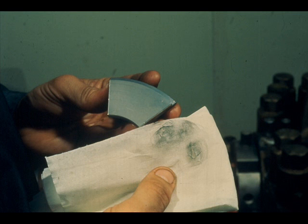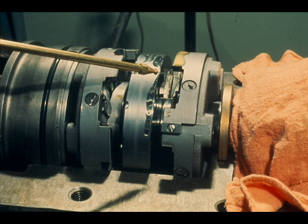Cleanliness is very important to the life of the bearing and should be stressed throughout the assembly procedure. The babbitt surfaces of the thrust shoes, for example, should be wiped clean before they are installed. The babbitt is not clean if it discolors a white towel, as this one is. Flood the thrust collar and base rings with oil. Coating the bearing components with oil will prevent them from rusting while the equipment is waiting to be put into operation.